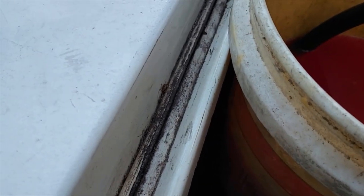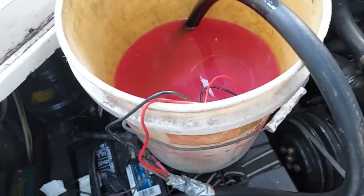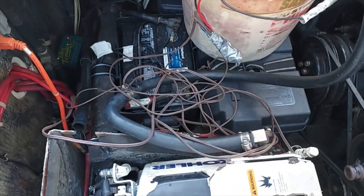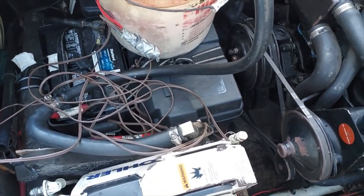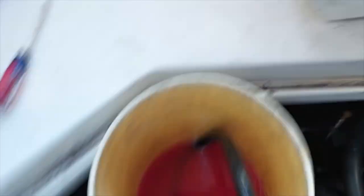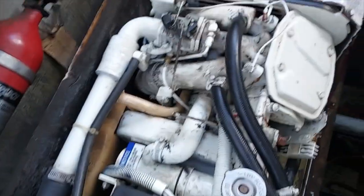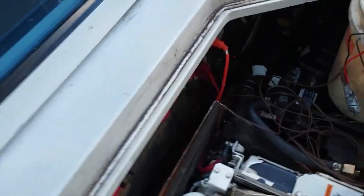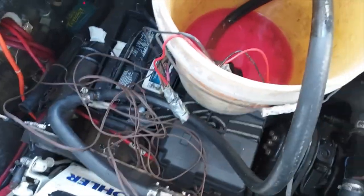There's your antifreeze with the pump down below — now we turn this on. You can hear it run, you can hear the fluid start through the generator. You see that water going down? See the pink coming out? Shut that off. The pump went almost dry — you don't really want to go dry, but that's how you do it.